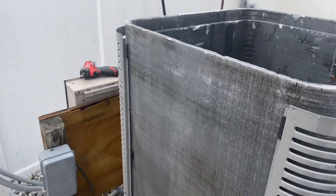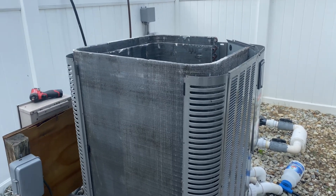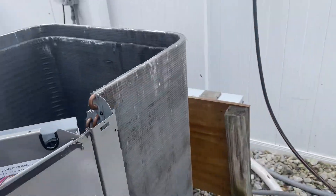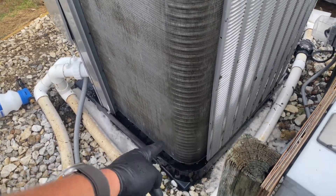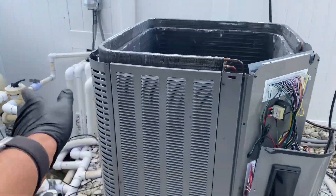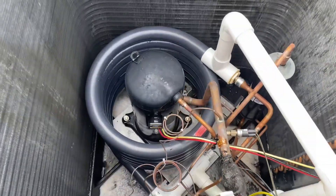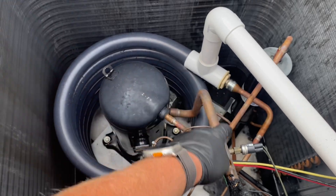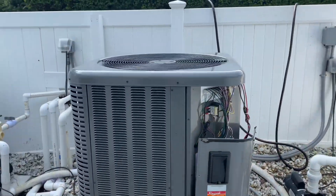The coil is fully rinsed and I'm starting to reassemble the panels. Best advice: put the end pieces in the corners first. If you try to put a panel on without the corner piece in place it's going to be hard because it has to latch in there. So do your corner pieces first. With all panels back on, for any DIY homeowner let's do some component verification: there's your compressor, this is a TXV, that's a filter dryer, that's a receiver. If you see any frayed or loose wires or something broken, you probably need a professional.